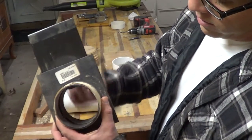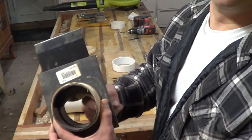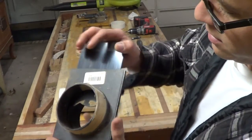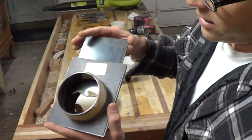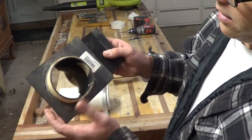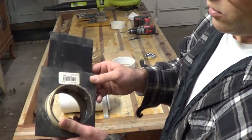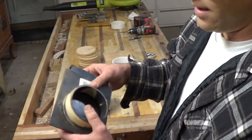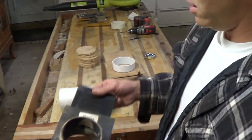The grooves that are in there allow that gate to go fully closed, but over time sawdust will build up in those cavities. There's a separation where the gate slides in a groove, and dust just gets built up in there, and then that gate will never close all the way. You're just losing all that CFM. Sometimes I had to get in there with a pick or a screwdriver and dig that out, and that's not something you want to do.